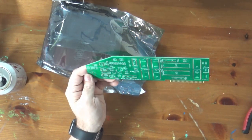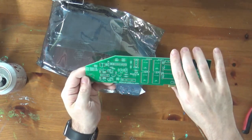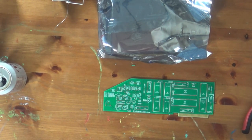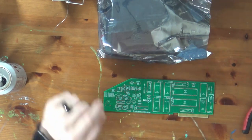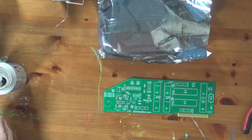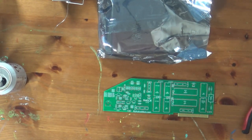So anyway, as I was mentioning earlier, the Apple II is a very flexible machine that's easy to expand in a lot of different ways. One of the limitations of the machine, however, was that the built-in sound was simply the speaker, which you could vary with pulse width modulation, but that's about it. It didn't give a lot of flexibility. There wasn't any built-in multi-channel audio support, or even a device like the Pokey for the Atari or a SID like the Commodore. So there's no noise track, no multiple voices or anything like that.